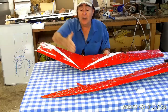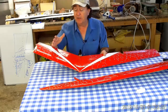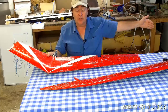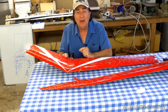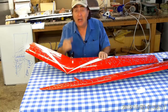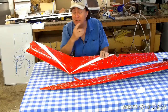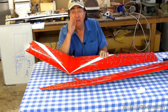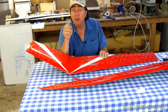The other winglet I flew inboard — so it's an asymmetrical configuration. This wing has the winglet inboard; this one has the winglet all the way out at the tip. Very interesting: it would only spin in one direction — towards the wing with the winglet all the way out. No matter what control movements I used, it would not spin in the other direction. That's when I really concluded that mounting the winglets inboard is the right thing to do. The effect was huge.